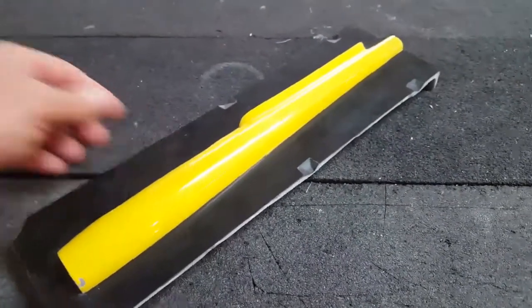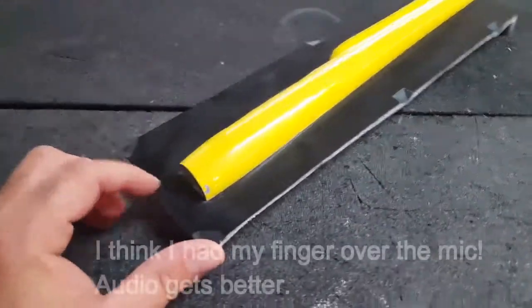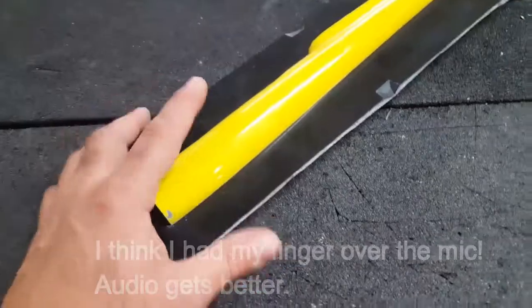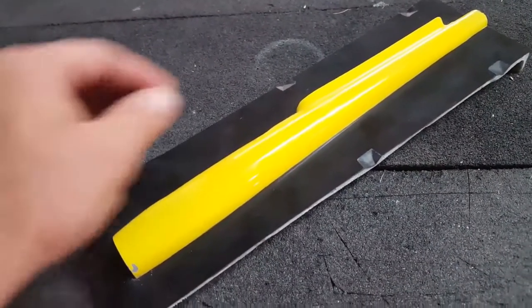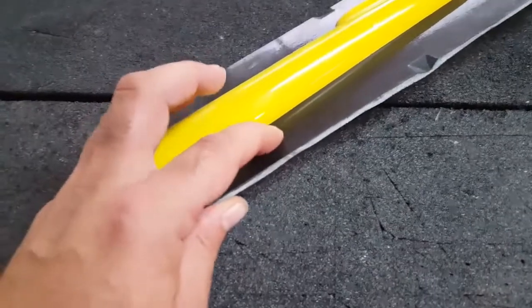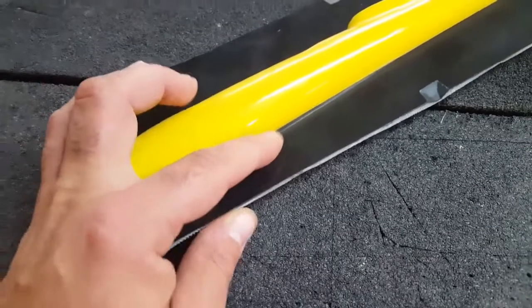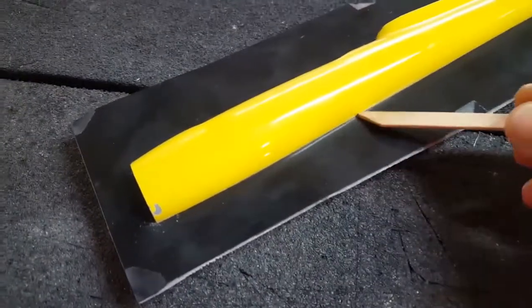Oli from Flight Comp with some progress on this mold I'm working on. Laid up the first half and it came out pretty good. Trimmed up the edge a little bit and right now I'm just doing a little bit of cleanup on some spots — had a little bit of really minuscule amounts of epoxy seep through, and I've just been scraping it off with a little stick and it cleaned up really nicely.